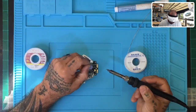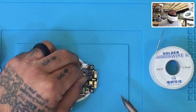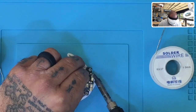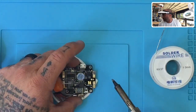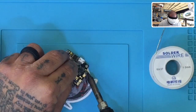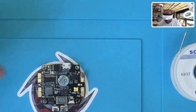I'm trying everything I can to make this work. Just watch the outcome. I'll keep applying it so you can really see the result. The outcome looks like a paste — it looks terrible, there's no shine to it, and its melting point is extremely high. It's not melting like a 63/37 should. This clump is what I get, and I solder a lot so I know what I'm doing. This is a terrible solder material — I don't know what they were thinking.